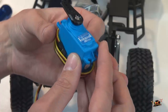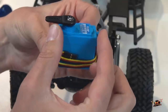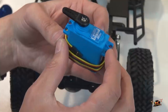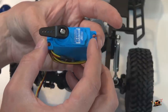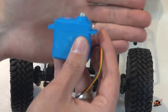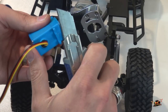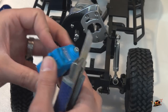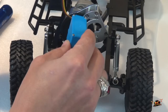On this particular model of servo we have these strengthening plastic triangles on the side where it screws in. This isn't going to be under a lot of high pressure in this rig — I won't be stressing this servo as much as in my bigger rigs — but I want to maintain the rigidity of where it screws into place. So to be safe I dry-fitted it first, and discovered those triangles were actually in the way. I removed them by taking a sharp razor, carefully cutting down the side and then cutting towards the inside of the servo — be careful, that little plastic piece is going to go flying.